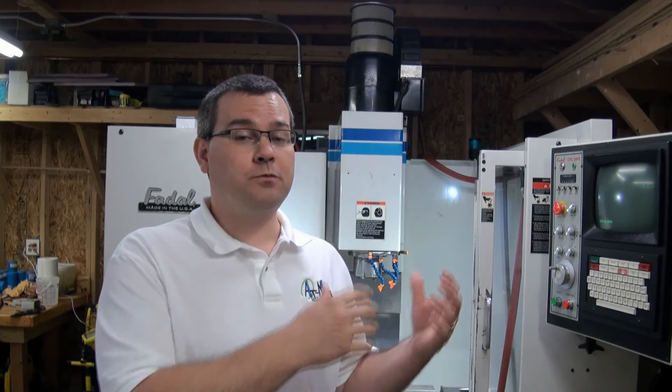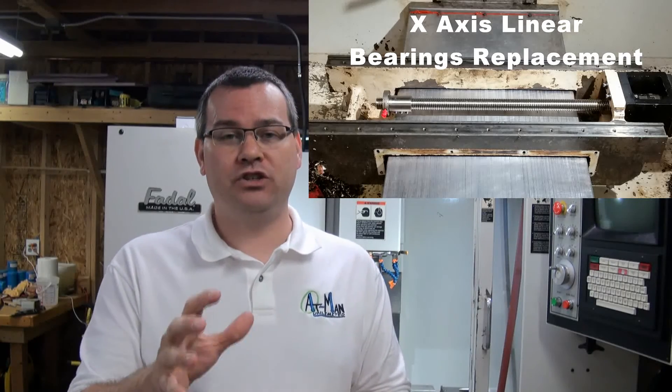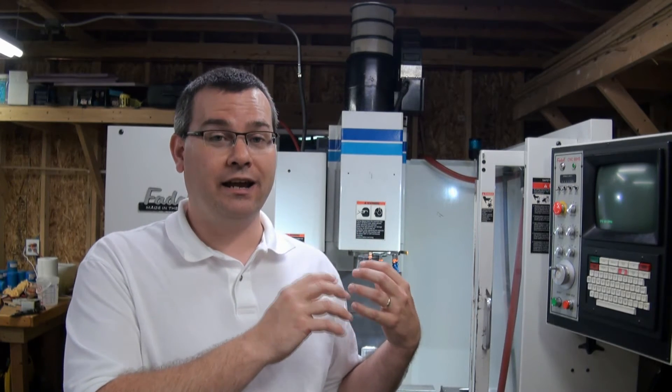Also related to whether you're learning or trying to manufacture: a personal CNC machine is a lot easier to learn on — it's going to be more forgiving. If you accidentally crash a personal CNC machine, chances are you're not going to do any damage. It doesn't have the mass or speed to create a lot of energy in a collision, and you're not going to knock it out of alignment. This machine, on the other hand — if you crash it in the XY axes at full rapid rate with one of these large tools, you're probably going to knock it out of alignment and possibly do serious damage. You'll find yourself walking on eggshells operating a machine like this without any CNC experience.